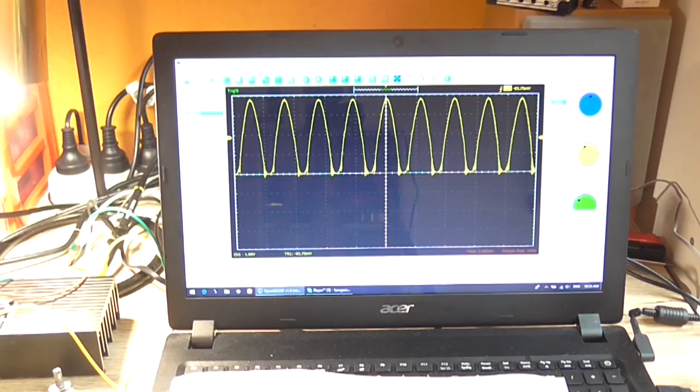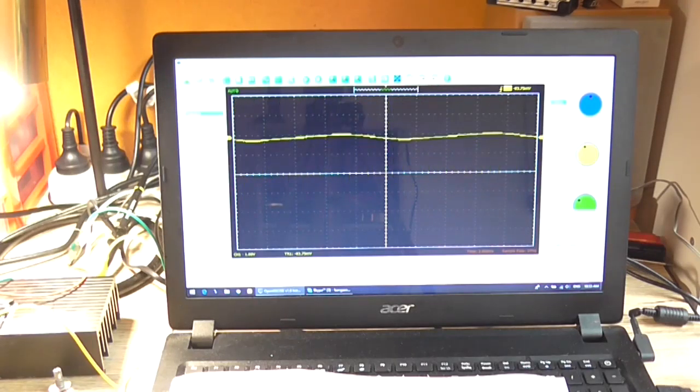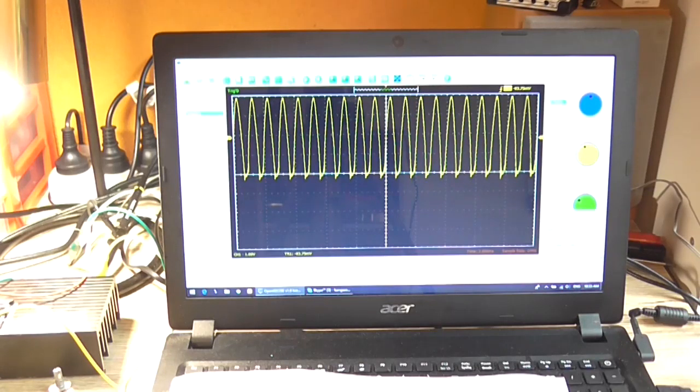That's at 450 hertz. I forgot that we're at a different frequency range now. Change that back to 1 kilohertz. 43.2 volt. Now, is that clipping though? Now I've got no signal at all. Yeah, we're getting 42 volt. It's not, that cleaned it up. It's not clipping yet.